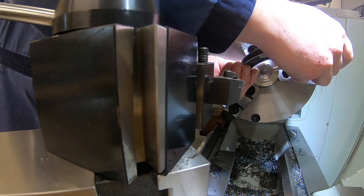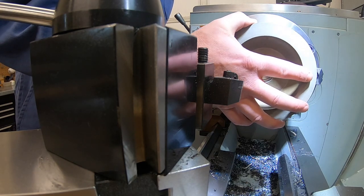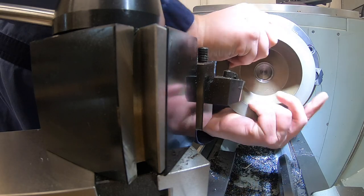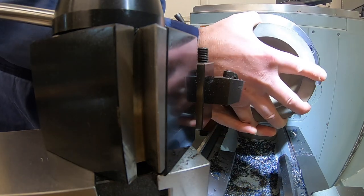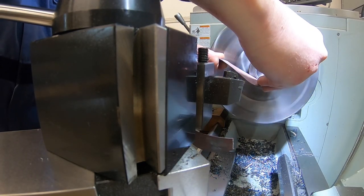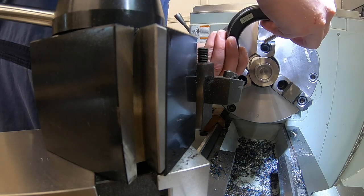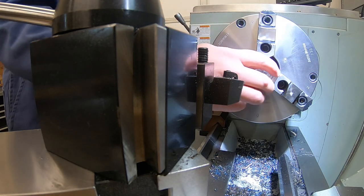Let's come back and measure that outside. We are 1.260. See how that wheel feels on there. Okay, well, that's a little snug. We'll give that a rub with a little heavier emery and we'll just shave that down just a little. Don't want it quite that tight. That feels much better. See how much difference we took off of there. Yeah, we're only down at 59, so that only took a thou off. I think that'll make for much better changing wheels out.